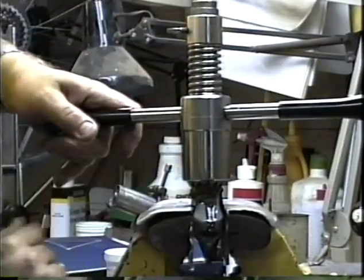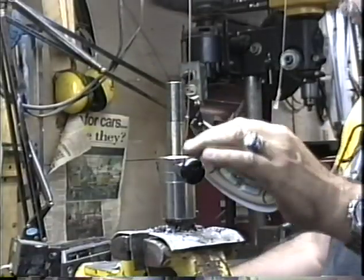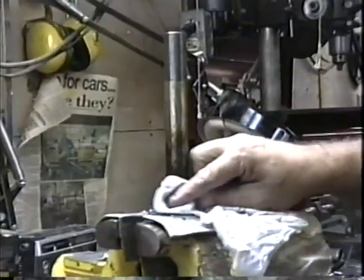It's going to take quite a while to go down. We've got to go down about 5 more millimeters, so you can figure I'm making a career out of this. Every now and then, squirt a little more oil in, and continue. Here we are, we're at the bottom of the cut. Pull this off, and we'll take a look. It's clean all the way around. We've got a good cut there, no chatter marks or anything.